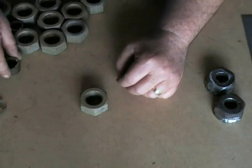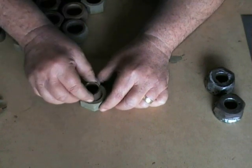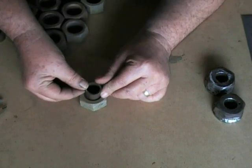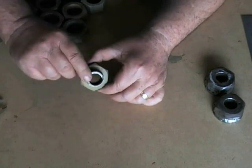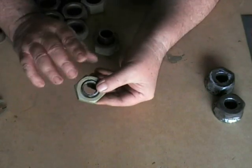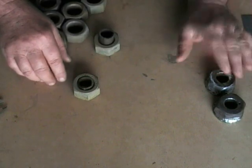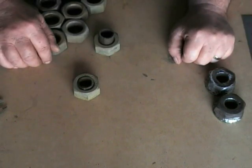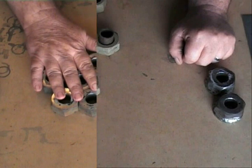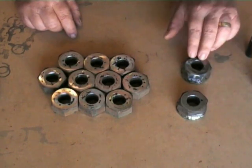We have the same set-up here. We have cut some more lengths of tube that will slip just inside — there is a neat fit, though you might have to hammer these down as it is a bit firm. We have 10 of these to do, much the same as the idler arm bosses. With our suspension arm bosses and idler arm bosses cleaned up, we move to the next step.